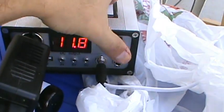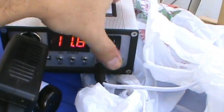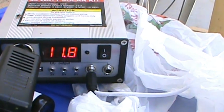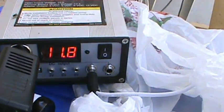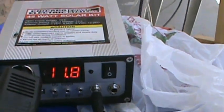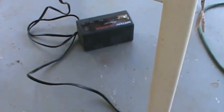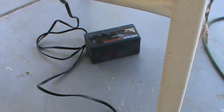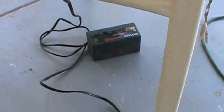Here's the connector for those lights you saw in front of the tubes. Each one of those light bulbs is 5 watts at 12 volts. At night, while there's no solar power, I put a 1.5-amp charger to help the batteries maintain charge while running that experiment.